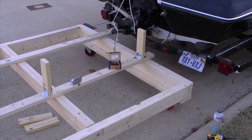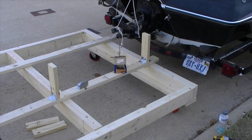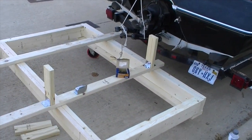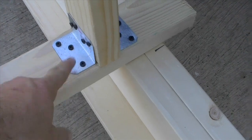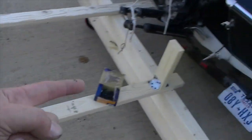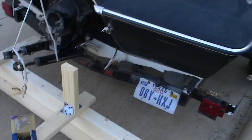We had to make another trip up to Lowe's or Home Depot — as Dad always jokes, it wouldn't be a project if we don't have five trips to Home Depot. We actually decided to get 12-foot-long instead of 8-foot-long runners here, to go all the way down so the boat can just slide right onto this. In the process, we're putting down these little holders to hold the two-by-four on, then we're going to flip it over at the right angle, and run lag bolts through into the cross boards. It's coming along fairly quickly — I'm going to try to get this off the trailer before dark, we've got about another hour.